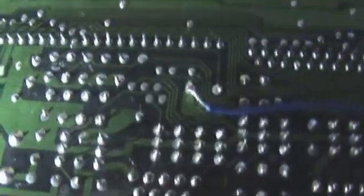Rather than using the leg of the capacitor like I was going to, which is this capacitor reel, I used the underside because it was a lot easier — because the leg of the capacitor is tiny. So if I show you where that is on the underside: flip it over and the controller ports are at the front, you want to look for exactly where this pin is. You get this row of 12, and then it's just this one up from it.